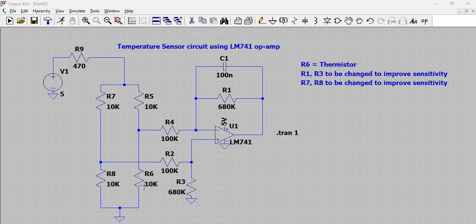If we take another case — as the temperature reduces, the resistance increases. As the resistance increases, the voltage at this terminal increases, and you have an input connected to the inverting terminal which is increasing. That means the output voltage is reducing because the difference is reducing. Simple, right?